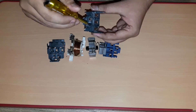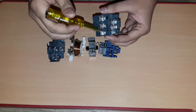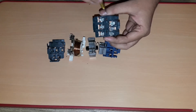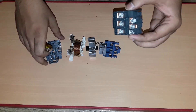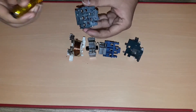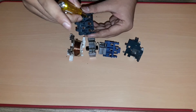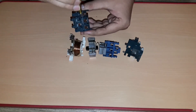And these are the fixed auxiliary contacts. You can see the terminals here — we have to fix up the conductor here. This is the outgoing part and this is the incoming part. Here also we have fixed three main contacts and fixed auxiliary contacts.